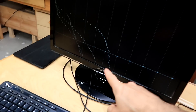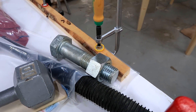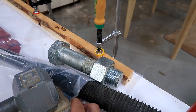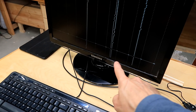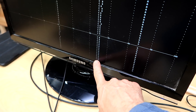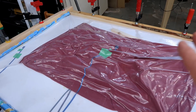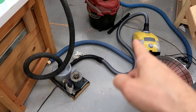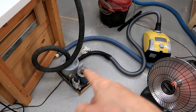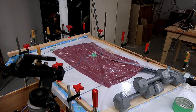Vacuum is still building up and I've got a fair bit of leakage here that I need to plug up. With tightening up the seal around here a bit, it's doing better. I've got about three quarters as much vacuum at B and C as I do on the edge, so the vacuum is spreading fairly well. Now I'll double up the vacuum — I'll actually suck with the blower to see how flat I can suck that pillow.